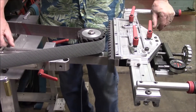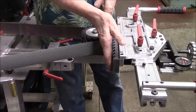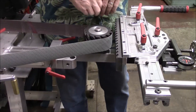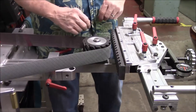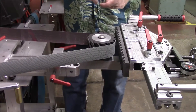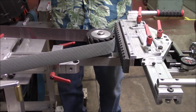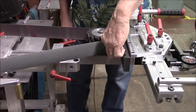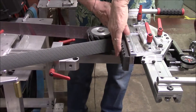The way that would work is if you put a part on your surface grinder and you've ground it in with, say, this wheel, then you want to change to another wheel. You put the wheel on, you put something on the chuck, and it's grinding — let's call it a thousandths wide part — and it's grinding a thousandths wide at the top and a thousandths narrower at the bottom, which would mean the wheel is tilted this way in relation to the chuck.